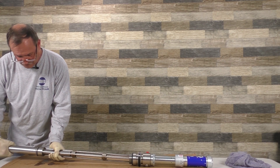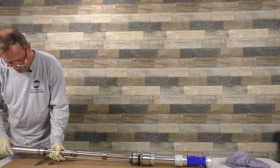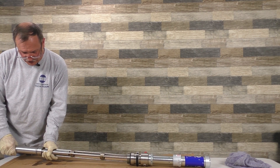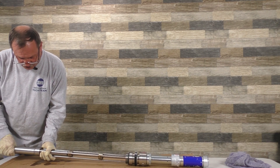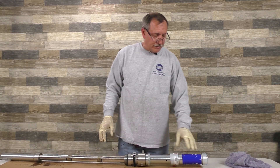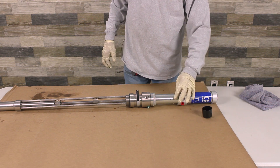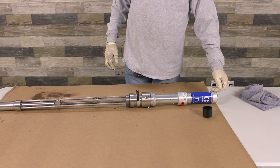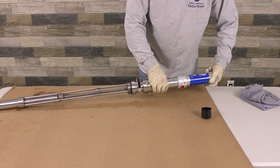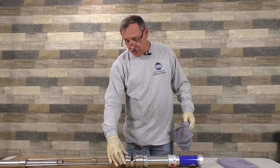As we talked about the rubber O-ring — as you're doing this, make sure you make it tight, but you don't want to cut that O-ring. It's going to seat itself. The main problems you may have is if you feel air leaking out of these three holes right here — that's in the air motor part. You need to go up there and look at those three little O-rings. That usually causes air to leak out of those. Hand tighten them. I see people get crazy with pipe wrenches — you don't want to do that because you're going to pinch the O-ring and roll it, and then you've got to go back and loosen it up. Tighter is not always better.